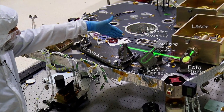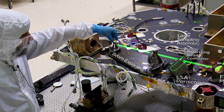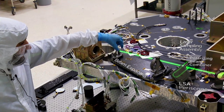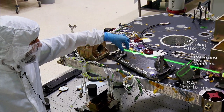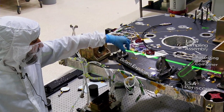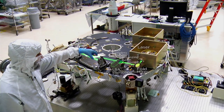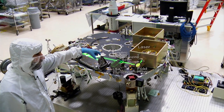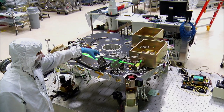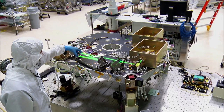The rest of the beam comes out through the PBC towards the beam expander. It hits the small mirror first — the beam is 10 millimeters at this point. The mirror has curvature to it, so it takes that 10 millimeter beam and expands it all the way out to 44 millimeters by the time it hits the second mirror. Once it hits the second mirror, it has curvature which re-collimates it, so now instead of expanding, it stays at a constant size of 44 millimeters all the way out through the rest of the bench.